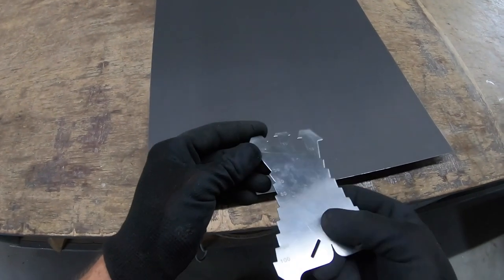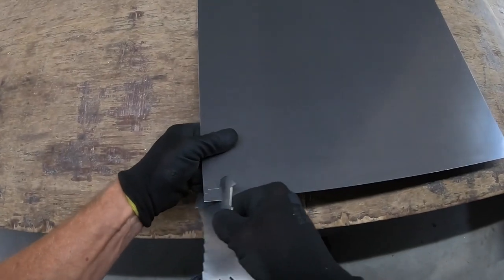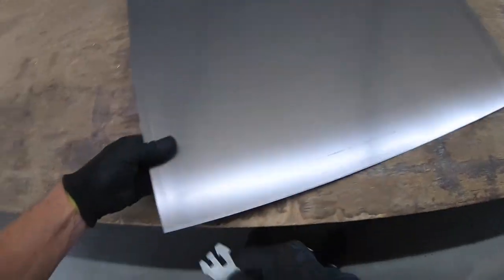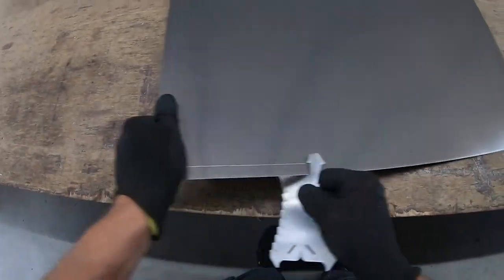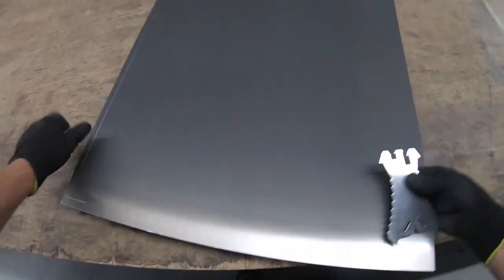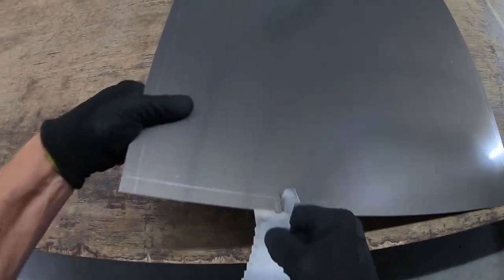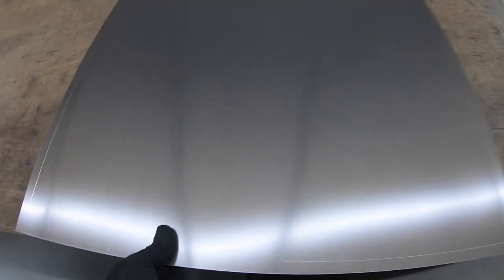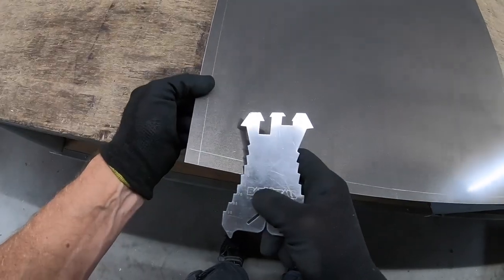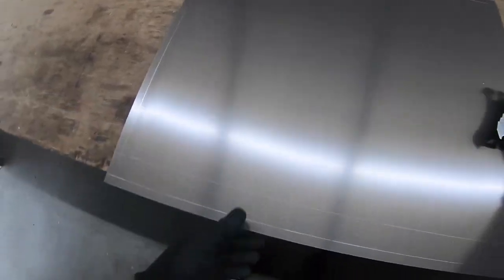I also show what goes into the pants, if anything goes into the pants, but I think that will be quite good. First I mark everything with 1.5 centimeters. I have left a little bit of preload to the outside so that it doesn't sag on the lid later. And then we have 5.5 centimeters here, because the lid should be only 4 centimeters wide at the side upstands or side bends later.